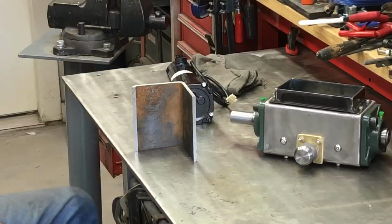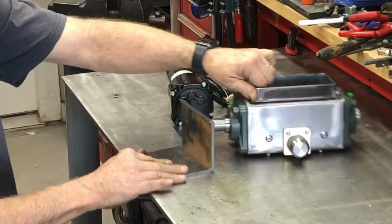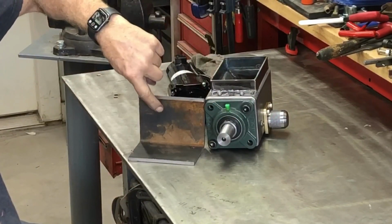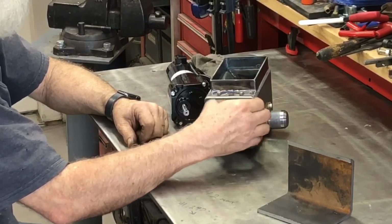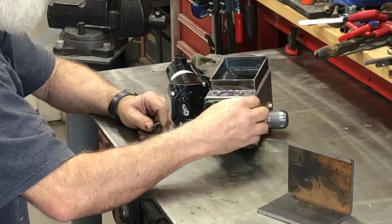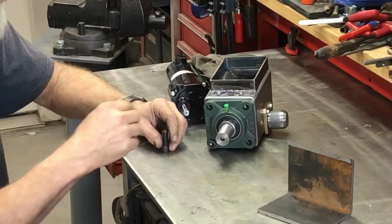There's another piece of that 4" by 4" by 1/4" structural steel. And what I'm going to do is put the bolt pattern of these pillow blocks right here in this guy, because on this side, that's what happens when you plan ahead. I probably got the wrong bolt in here. Oh, I didn't. See? These are 1" bolts as opposed to the 3/4 that are going through the other one.